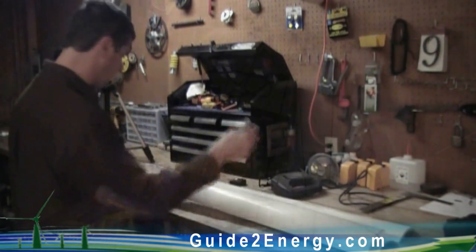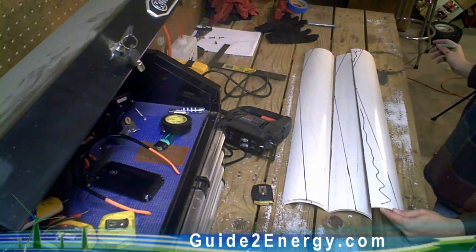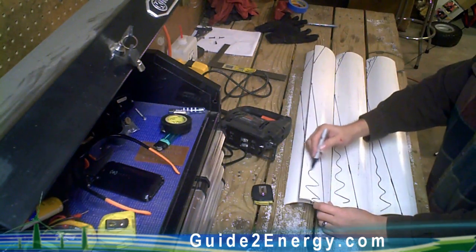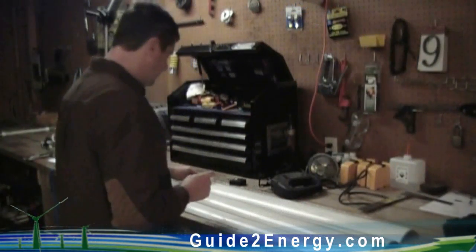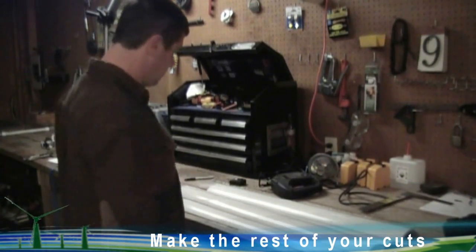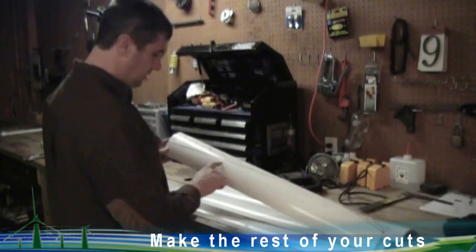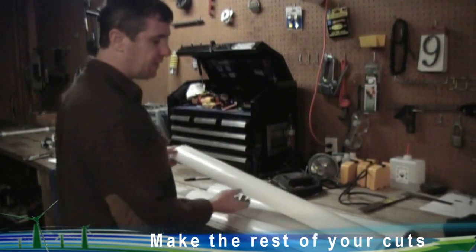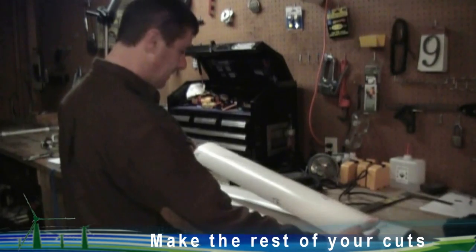This is the smaller PVC I'm showing you here — you can see it from the top view. We're going to cut these sections out here. I'll mark them off so you know where you're going to be cutting. When you do cut your lines, make sure to cut on the outside of your mark line so that you have room to sand and make adjustments if you mess up. I have a line here and I'm going to run my cut just on the very outside edge — the waste side of the cut.